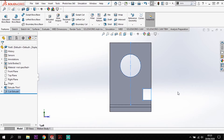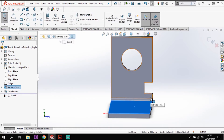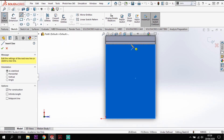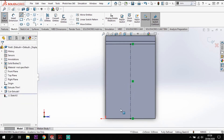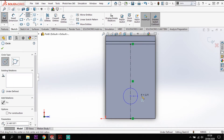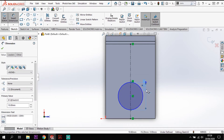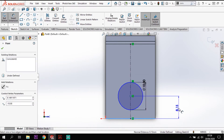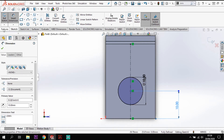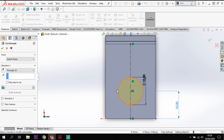We've cut those out of the top face. Now we need to cut them out of this side face — on this face I only have the circle. I'll sketch on it, put in a center line down the center of the face, place a circle — same size, 10mm diameter — and it is 10mm offset from the bottom edge. Then go to features, cut through all, and we get that cutout on there.